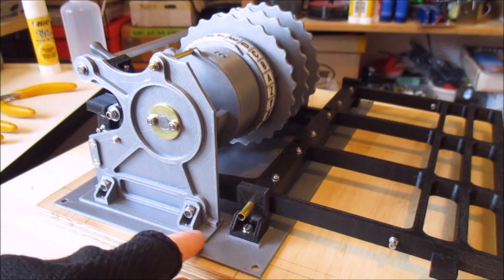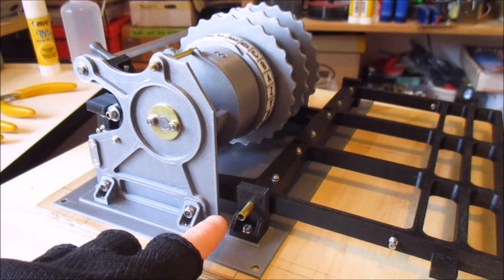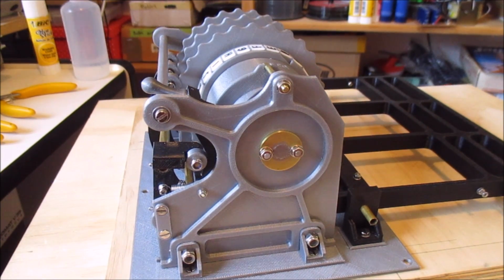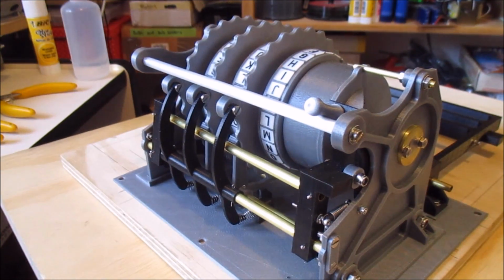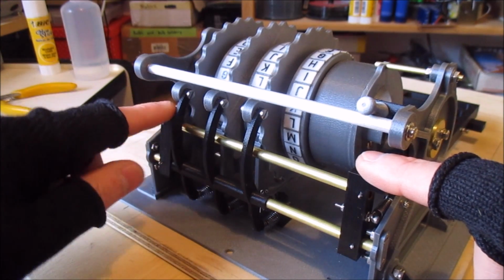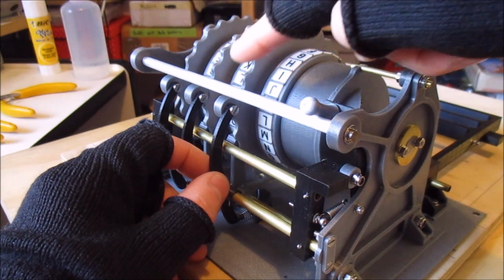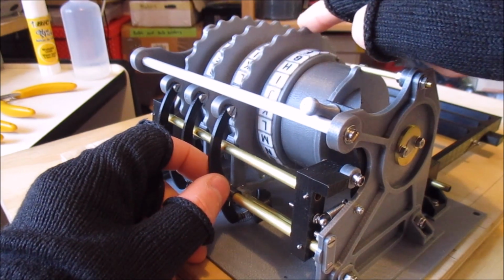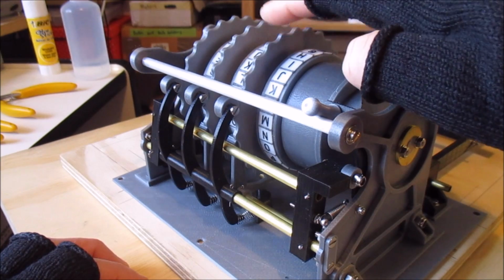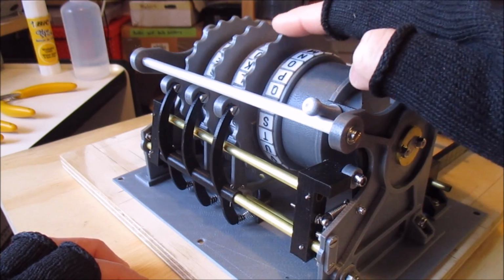I've also modified a little bit from the original Enigma design how the pieces are mounted so that it's easier with 3D printing. Printed these little corner pieces. Everything's bolted together to hold it all in place. I think in the last film I did, you could see I was having problems with flex in this bar. And this bar is what's holding these little springy arms. These arms run in the little scallops on the edge of the rotors. As the rotor clicks round, that's what maintains the stepping, the positioning of each rotor, so that it's got a definite position. That's what gives you that clicking.